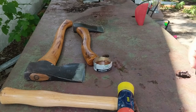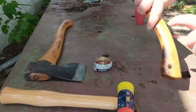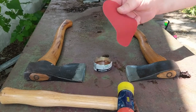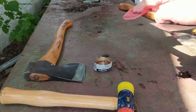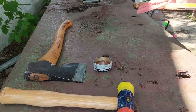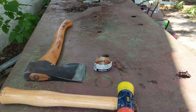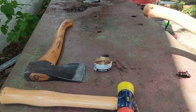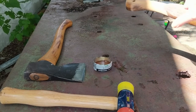Now on a piece like this one you can still see some good finish, but to get into it I like taking these Diablo sanding discs because they don't wear out very fast. I give it a quick scuff, especially in areas where I want to thin the existing finish down a bit — that helps the new treatment get in. This is 120 grit, a little aggressive, but you can flip most of the disc over and just keep using it, so these discs last quite a while.